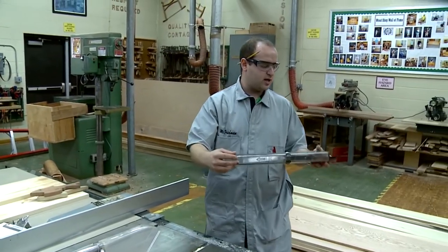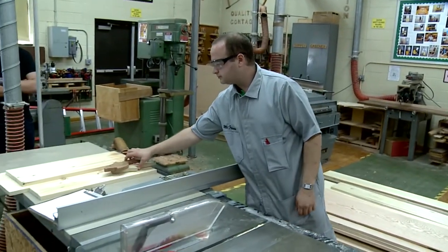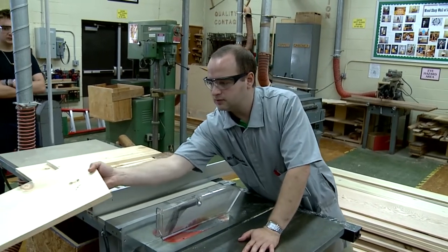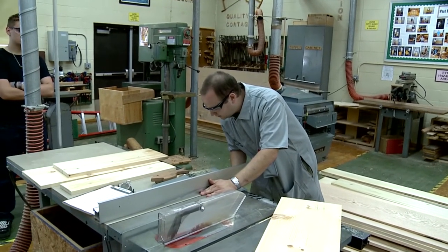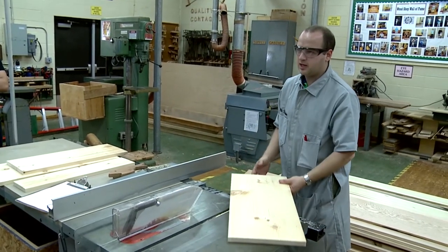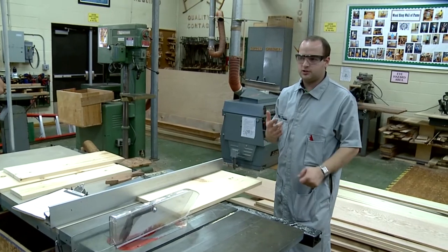All right, I'm gonna pass this around. You guys can check it out. And we're gonna get set up for our cut. Okay, can we see the board again? Thank you, sir. All right, so we've got the blade height set. We're gonna set our fence back to 11 1/8, just like that. Okay, and we're gonna make just a practice cut to review, and then we'll get you guys all started.